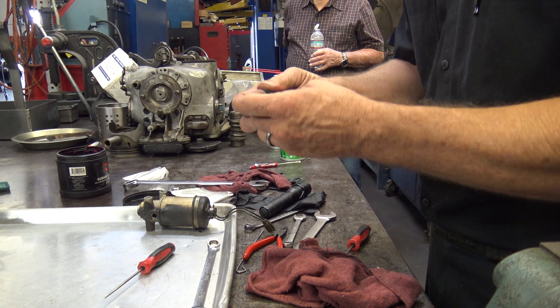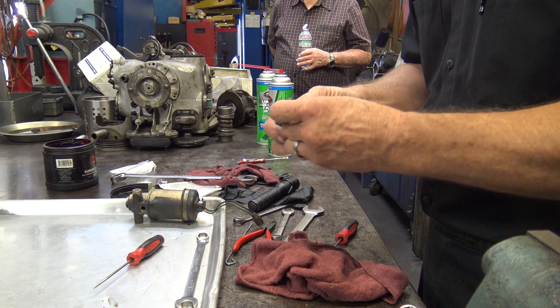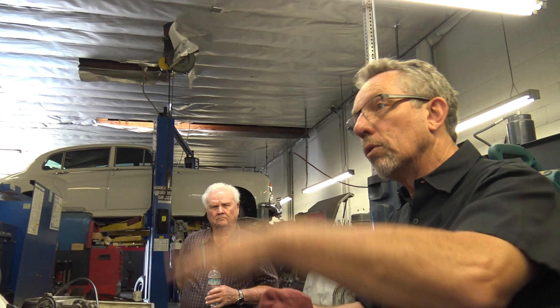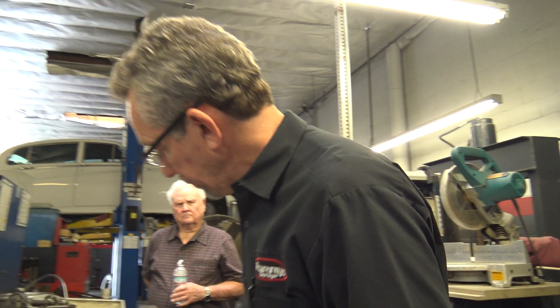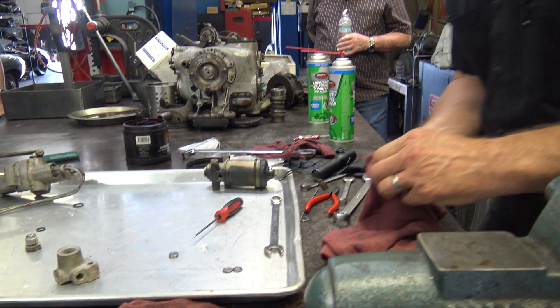On the mineral oil cars, they have a valve that's a priority valve, and then they have a minimum pressure valve. The priority valve is designed to turn off the rear hydraulics when you have marginal brake pressure — so when you first start the oil car, your hydraulics are not working in the back until you get full pressure. And then a minimum pressure valve controls the amount of pressure to your gas springs, which control your shocks and also the ride height. Those are set with a gauge when done correctly.